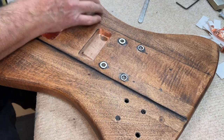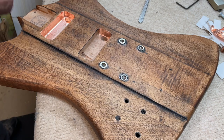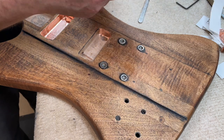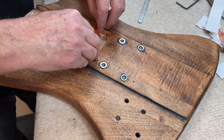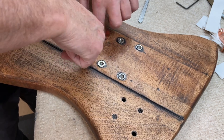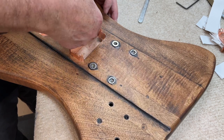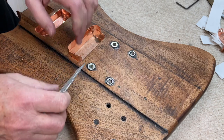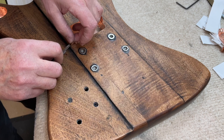But I think the hardest bit, I was going to say, is fitting up the wiring. And I just got a sudden thought that I didn't bring my wiring diagram, but actually it's a pretty standard thing. It's two P90s in a three-way switching operation, the only difference being the switches up there. So I can just draw it out on the board and work from that.